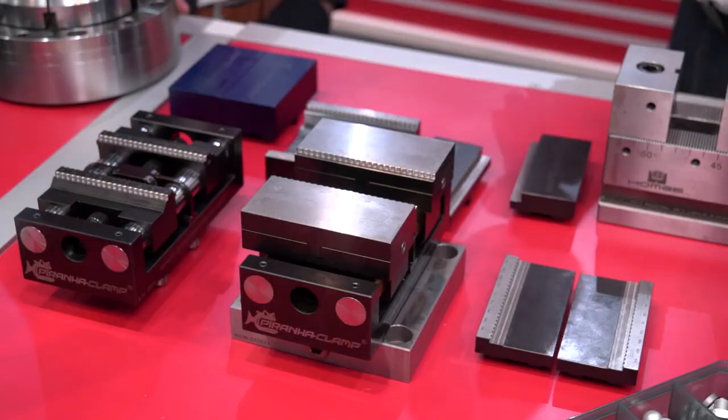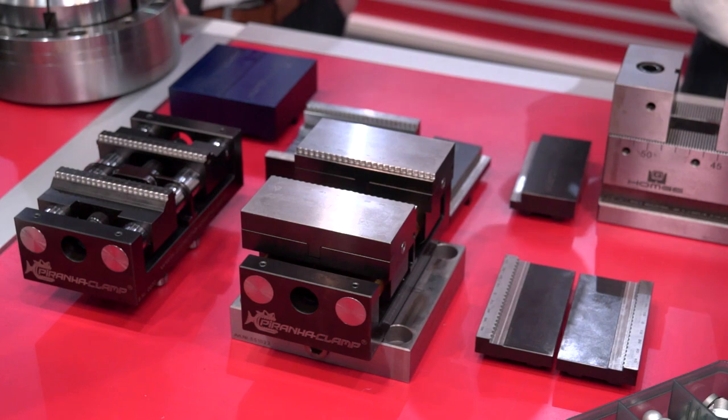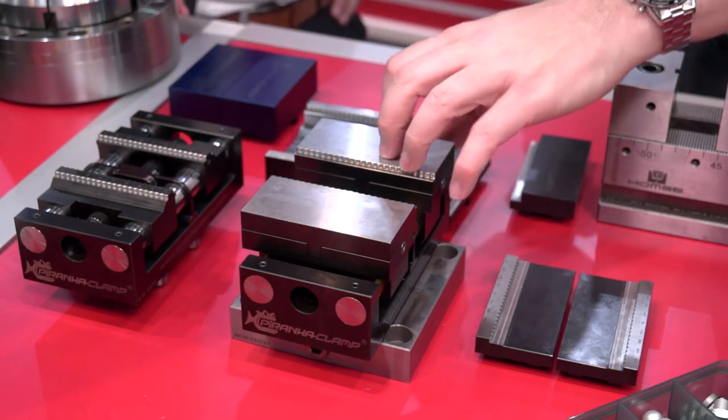So there are actually two rows of teeth in there — yes. Now, it's unusual as well that the actual clamp itself is open. We made it open because chips go all the time into the vise, and everyone tried to close it, but it's impossible. So we make it open and the chips can fall out. You're always going to get some ingress, so rather than stop it getting in, you've found a way to simply clean the clamp — yes, exactly.